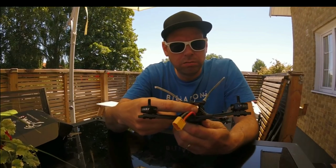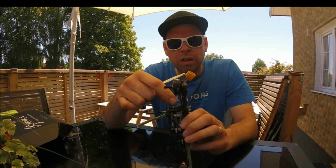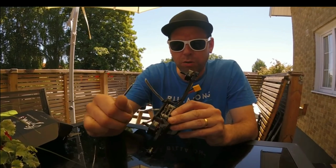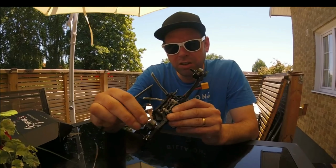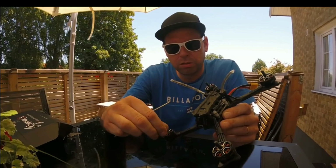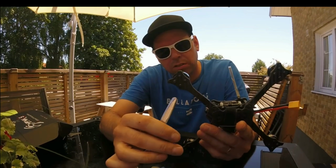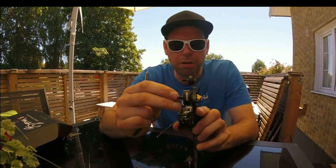and you get a cap for clean video and clean gyro updates. The nice 2206 2300 kV motors feel coggy and nice. I believe very good bearings also, and it's missing that center hole for the engine, and that's good, so you don't get all that dirt and shit up in the bearing. So I believe the bearing is gonna last for much longer.